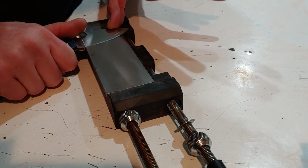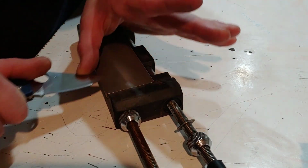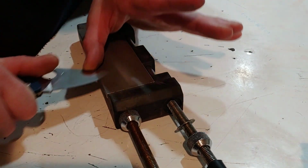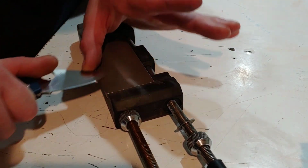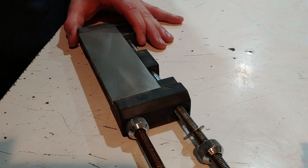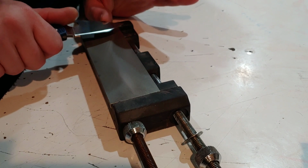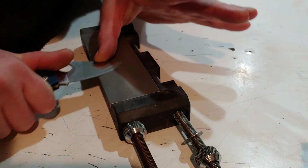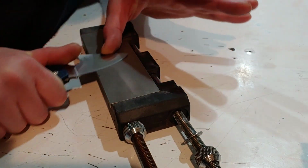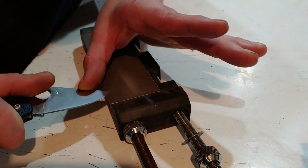With the burr, you can get by with just, once you've got the burr, going to the other side and knocking off the burr. You can do it like that. But sometimes you do wind up spending a little bit more time going back to the other side you already did, just to fix something. There's going to be a lot of times when you do that. But you don't want to do that too much because you don't want to leave fatigued steel.